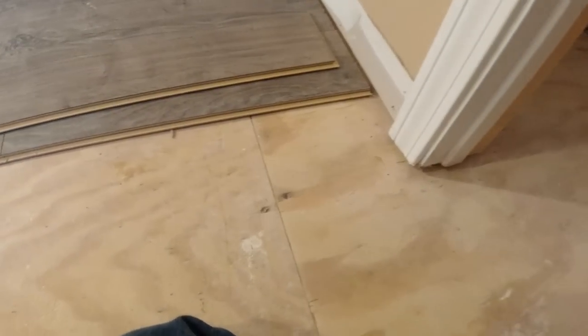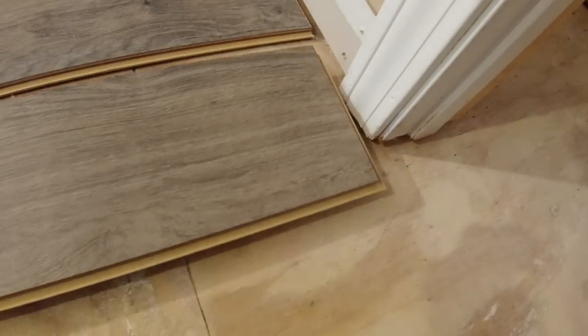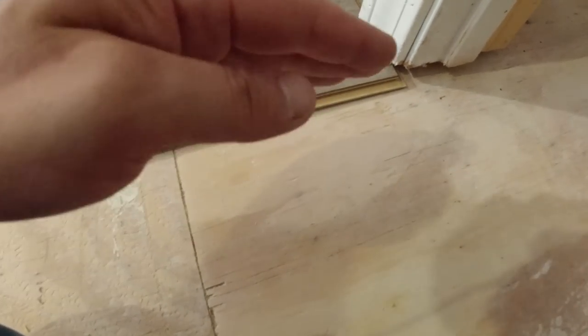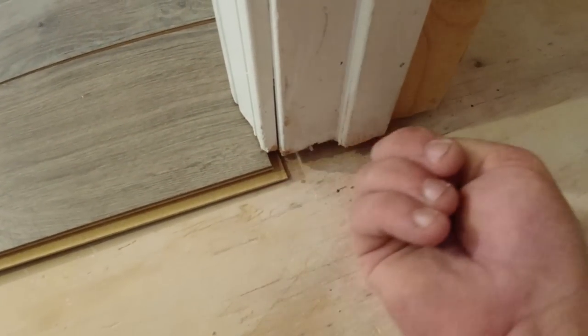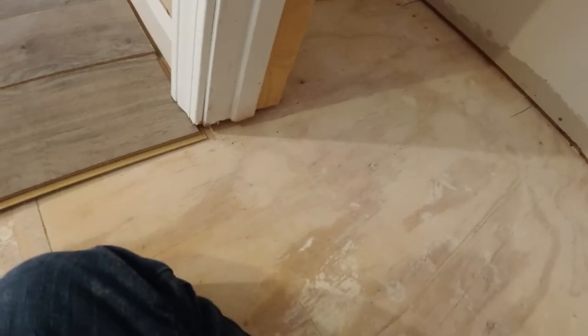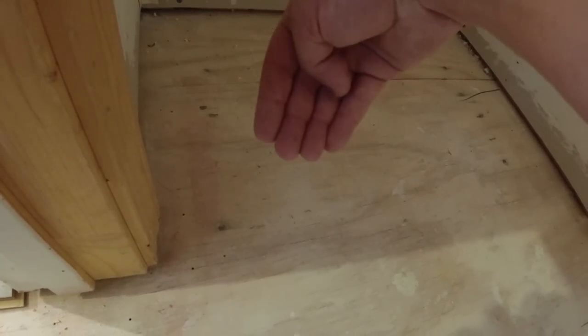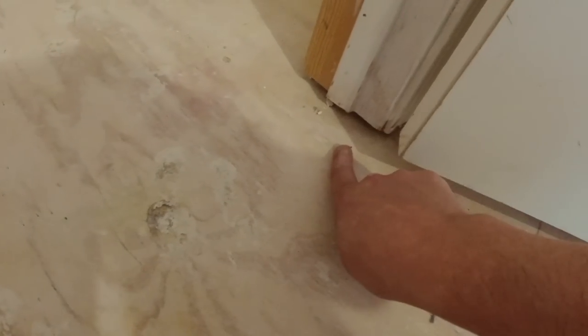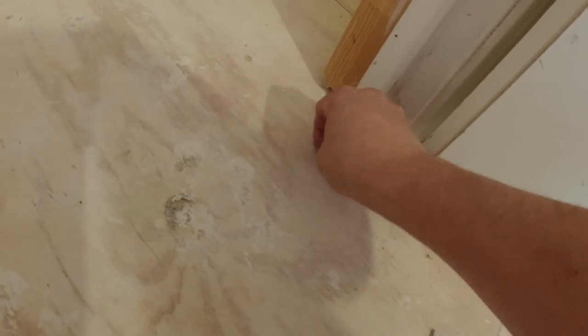So now this piece — I'm at the closet, which gets a little tricky — but it turns out I lucked out here because this piece is going to go right here, and then like this. So I think the next piece is just going to go right under here. I undercut this entire jamb to make it easier, and I can carry this throughout this way. And then on the back side, I'm going to keep going with the floor this way, and then on the back side I'm just going to tuck that tongue under the other flooring and snap it in that way and just hammer it into place, and then continue it this way. We'll have to do some notching and whatever we can to get around this door jamb.